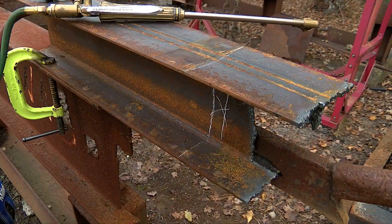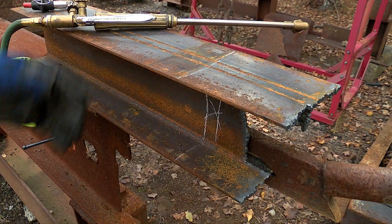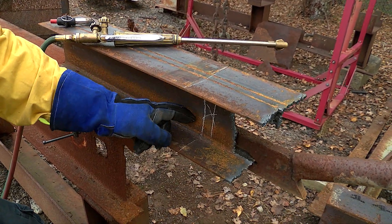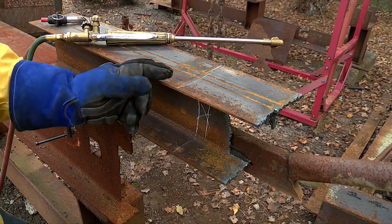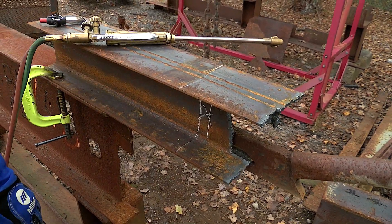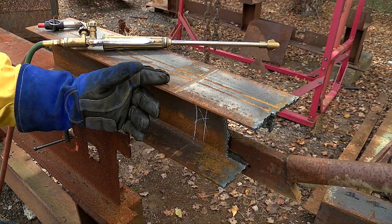The process of instruction starts our students with cutting the top flange of the I-beam, then cutting the web from top to bottom. We're constantly looking out for movement in the beam. Every time we do this, based on the metal and the amount of cantilevered weight, it's going to be different. We need to treat this with respect and be watchful for movement.